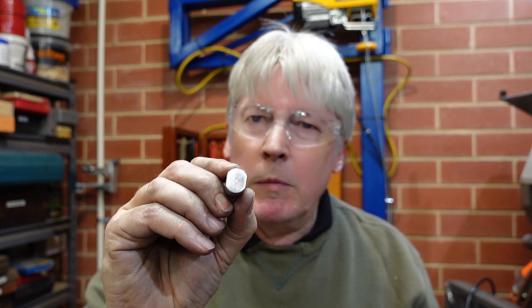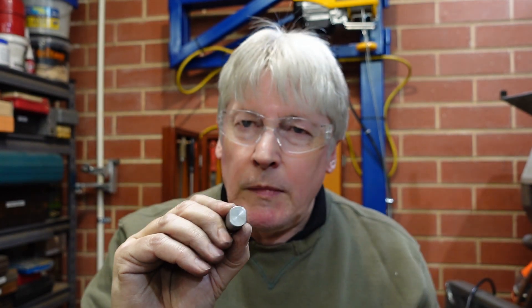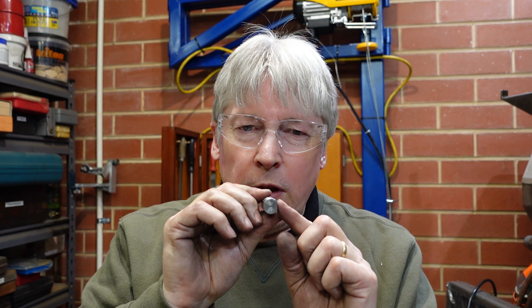G'day. The other day one of the engineers at work came up to me and said can you make a special hole for a connector? It's what's referred to in the trade as a double D - basically a round shape with two flats on it. For electrical connectors they like doing that because it means it's not going to twist when they do things up. For those of us who have to make the holes it's a pain in the neck because you can't just drill a hole - that's a 5/8 inch hole - and pretend you haven't taken some off the sides. So it required a different approach.